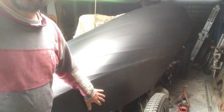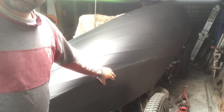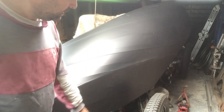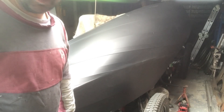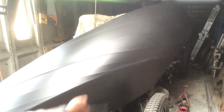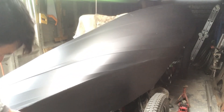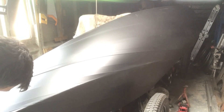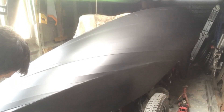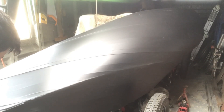I'm trying to make a template for the side here. I've got some marine plywood for the sides, so I've bought this floor protector sheet material — now quite expensive actually, but a lot cheaper than a new plywood sheet — to use as a template. The good thing is I can reuse it for templates any time. I've roughly got it in place and I'm going to cut it to the shape I need.